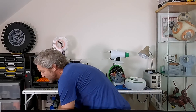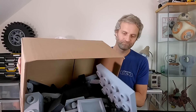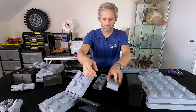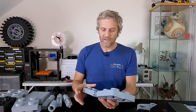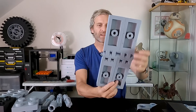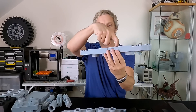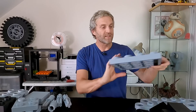After several hours of printing I've got a box full of giant Lego parts, which should be most of what I need for my giant Lego seat. Most of this assembly is going to be glued and bolted, but I'm going to do a dry fit first. I've already bolted this hinge together — there are two hinges, and by tightening up the bolt through the hinge it really stiffens up the joint, which helps keep the seat in position. I found a nicer way of putting these together: I've embedded an M6 nut inside a recess in the back, and that takes an M6 cap bolt through which picks up the nut on the back side — it's hidden when it goes together, which is quite nice.